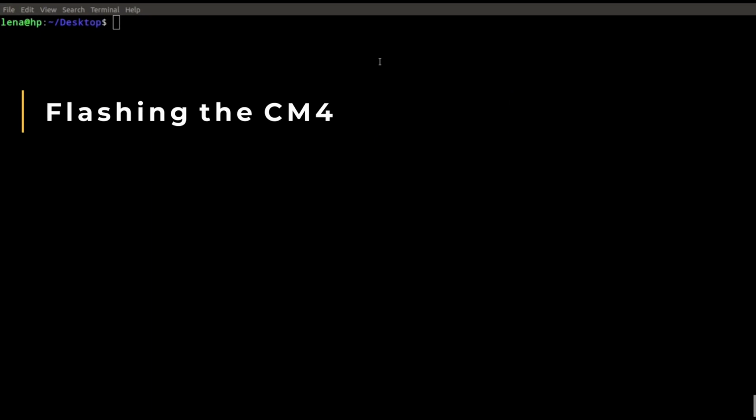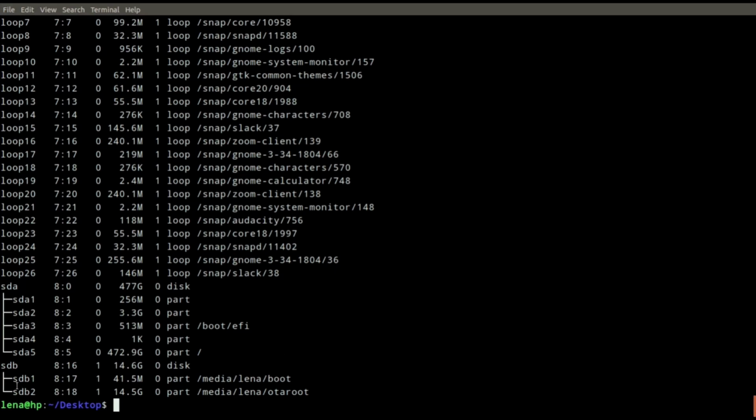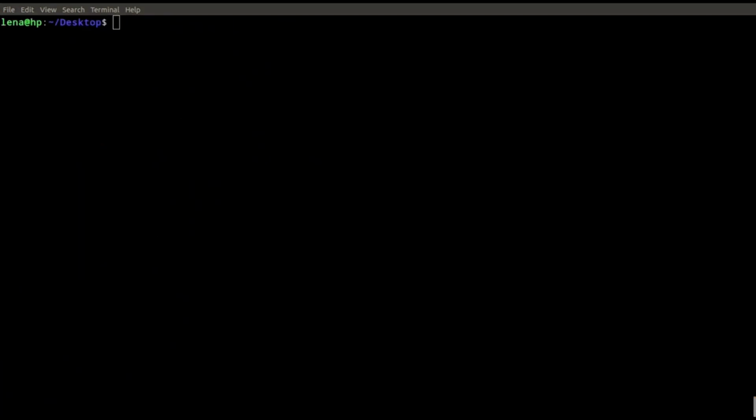If you have a Linux OS, you can write an image to the eMMC from the terminal. First, run lsblk and check where a new device appears. In my case, I found the compute module in /dev/sdb. It could be another location, so it would be a good idea to run lsblk before rpiboot to see the changes. Also, it is very normal to have no partition if it is the first time that you boot the device. Now you'll need to find a directory that has a raw OS image and cd into it.